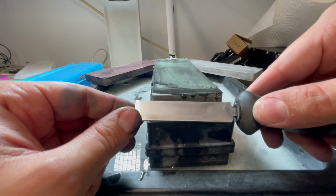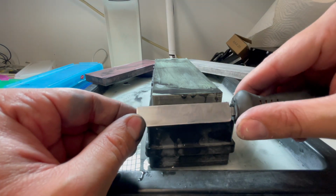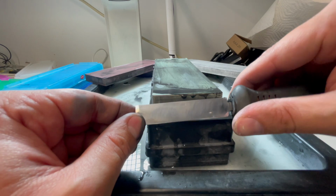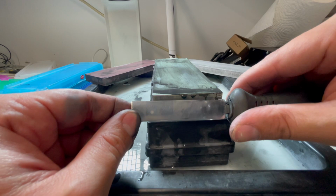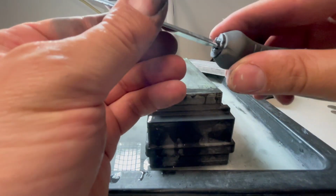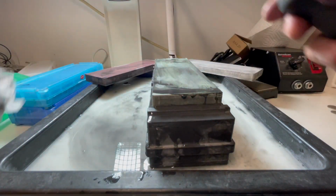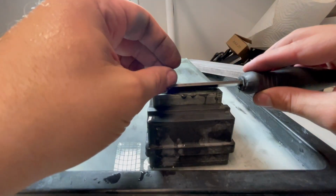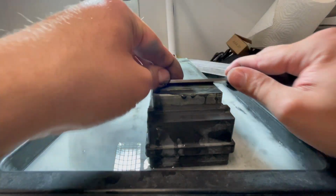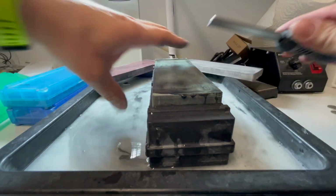That looks pretty good. Again, it's a little stained, but you can see it's not mirror polished. If I went up to a 15,000 or 30,000 grit stone, I could get there. But I think for our purposes, that's a very nice burr going backwards, against the cutting edge. So now that I've accomplished that, I'm going to put the burr forward, and we'll see if we have a reed knife that scrapes. And we'll get a reed and test it out. See if we can just get a nice, easy burr.